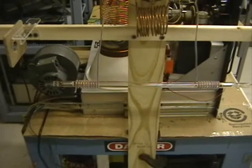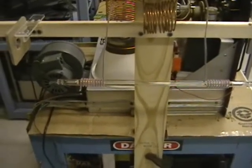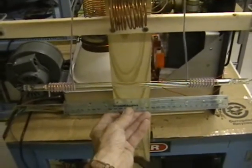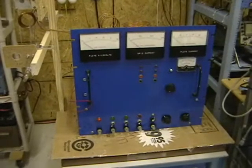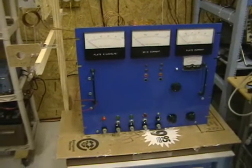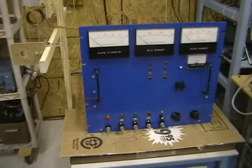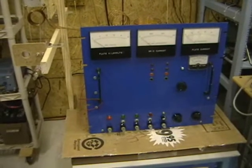The tube is excited by a capacitive discharge from spiral wire coils on the ends of the tube. Approximately 10 inches of the tube is active during operation. The RF power source for the tube comes from a modified amateur radio amplifier, which is designed to produce approximately 1,500 watts peak power output during normal operation. The unit has been substantially modified to work in this particular system.